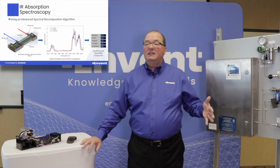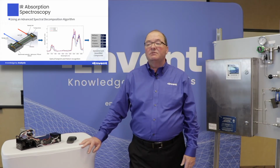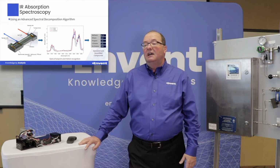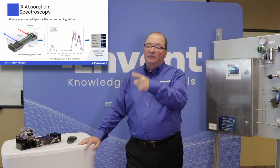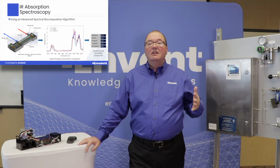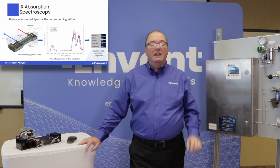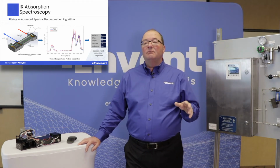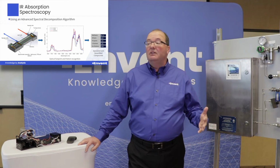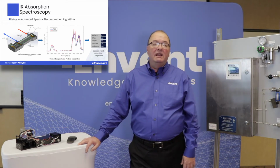Okay. So we see that you have your sensor that's located with the light that's emitting in and doing the absorption. You see that we're isolating the two different wavelengths where the light absorption occurs. And you'll see also that all the different absorption curves are over top of each other. But since we have characterized the sensor, the analyzer keeps looking at each of those peaks, and it can identify each one individually by using the algorithm, or the modeling, to determine what the actual area is on the absorption curve for each of the components. And as a result, we get actual isolated measurements of, for example, methane, ethane, propane, normal butane, isobutane, and so forth.